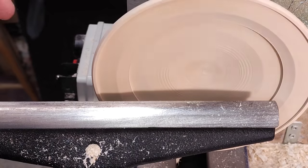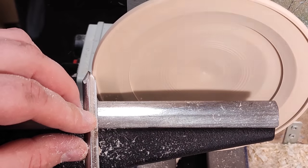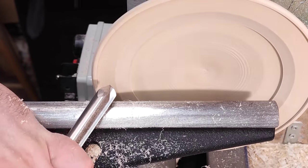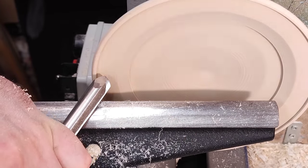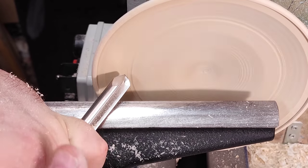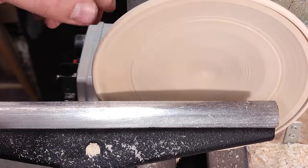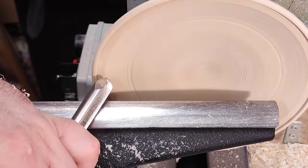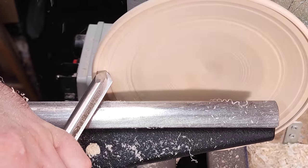Now what I want to do is chamfer this and extend the bead here on the side with just light scrapes. With the bowl gouge I just want to take a nice shallow curve down to the bottom — around a quarter of an inch from the edge. To copy the work like this I'm using practical measurements: quarters of an inch from the edge, or the same thickness on the side for the bead, instead of calipers or other measurement devices. Just easier and faster.